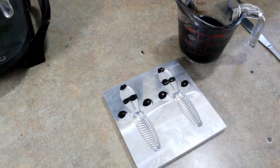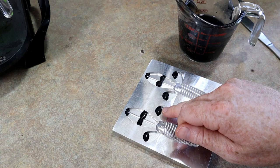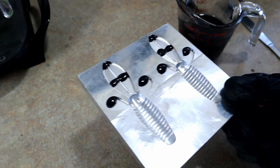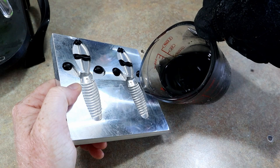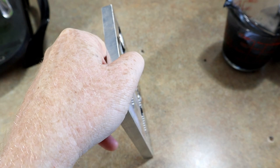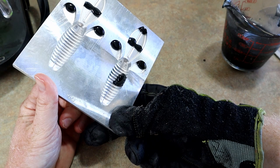We went ahead and poured just the tips in black, so we have kind of a three-tier: black in the back of the wings, black midway through the tail, and then black tips on the tail. Now we want to get a little bit of black in the body. Similar to the release video, we're going to pour cross-ways - you can just place it individually, tilt it right, place it right there and let it run up a little bit. You can just sort of polka-dot the mold.